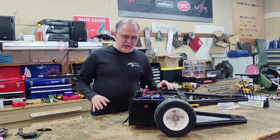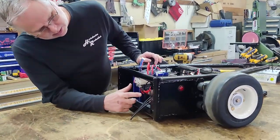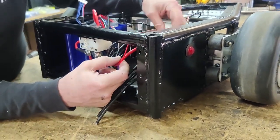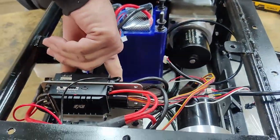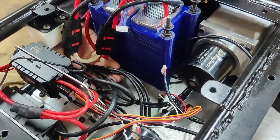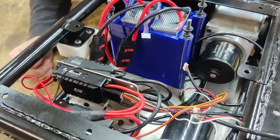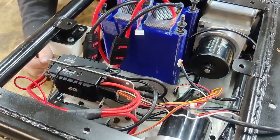At this stage the robot itself is wired up. We've got the power switch back here — main power coming in from the batteries, main power coming out to the LED and to the speed controllers. I've got the negative block here for all the other things that's bolted up. The wires are wired in to the motors other than the weapon motor — I don't have the weapon motor in yet. But as far as the drive stuff is set up, it looks like a sea of wires, but this will all clean up really nicely in here.